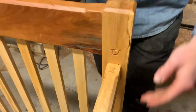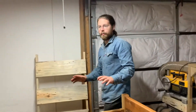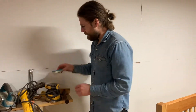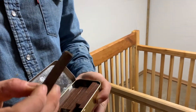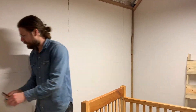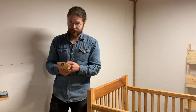Once it's together, you're going to drive pegs through the holes and the whole thing will become very rigid. I designed it to go together with these slightly less than half inch by half inch hardwood pegs — this is a tropical Ipe peg. Because I put a slightly decorative pyramid shape on the top, you want to drive it through with a little bit of leather and a wooden mallet.